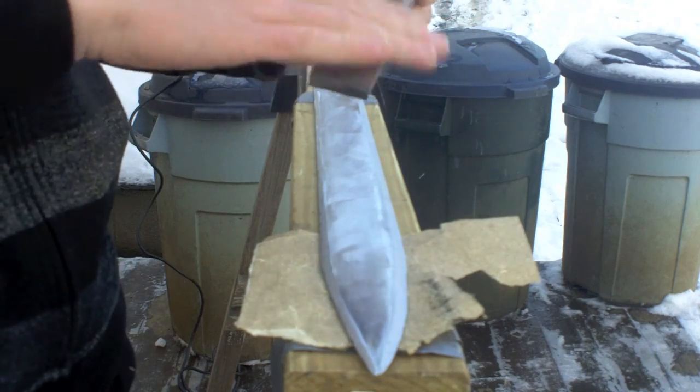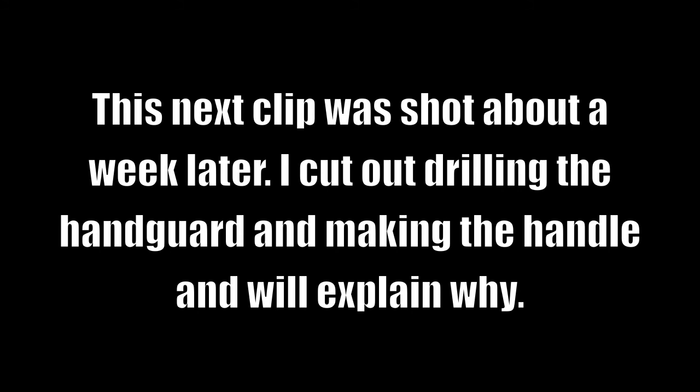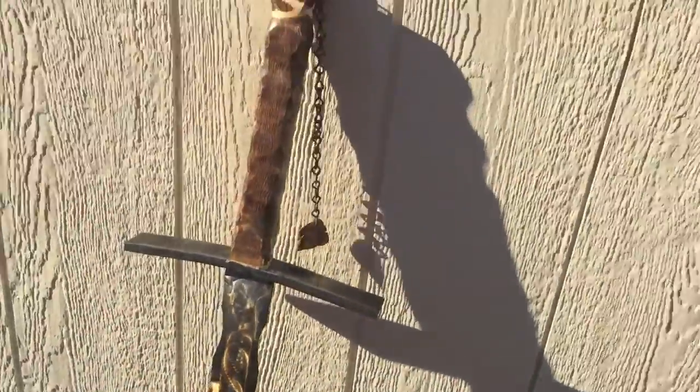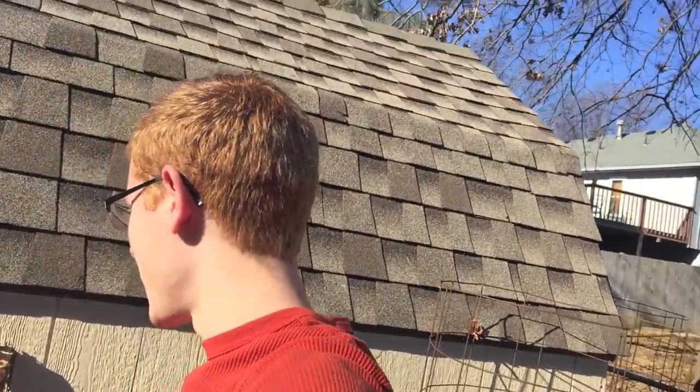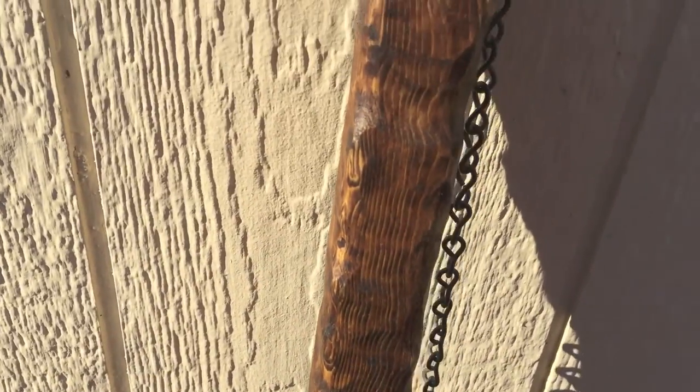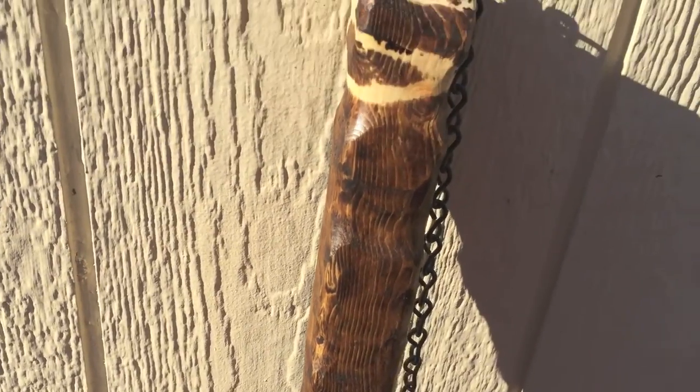I'm gonna go ahead and use it for the hand guard and I need to refine the center. So this is the finished sword, and I feel like I just jumped really far ahead, so I'll explain that quickly. There were a few things like making the hand guard and the handle that I've covered in other videos. Making this hand guard wasn't anything fancy — I just drilled holes so it could slip over the tang. The handle I just drilled a hole in a piece of wood and beat it up on the belt sander. I actually have a more detailed video in the description where I did a wooden pommel — this one just has a built-in wood pommel.